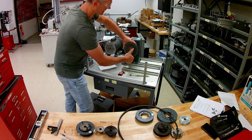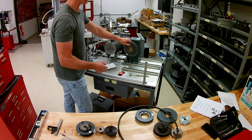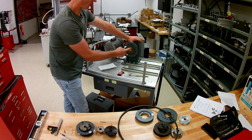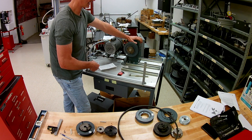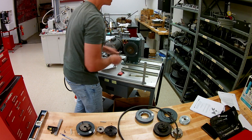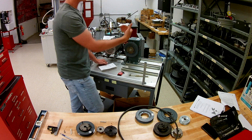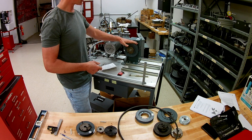Now in an industrial installation, yes, we're going to put a lot of tension on this, but for here we're not going to over-torque that — we're going to keep that minimal. But as you can see with very little torque on those bolt heads, that taper assembly just took over and really locked it onto that shaft. So we're installed, and if we want, we can take it, look over top of it, and give it a quick spin. You should notice no perceptible wobble in this particular hub right here.